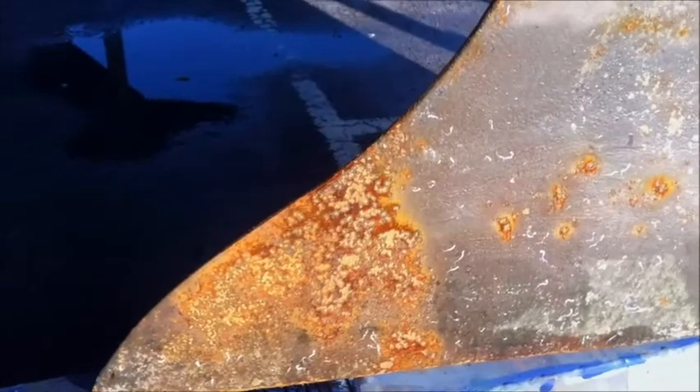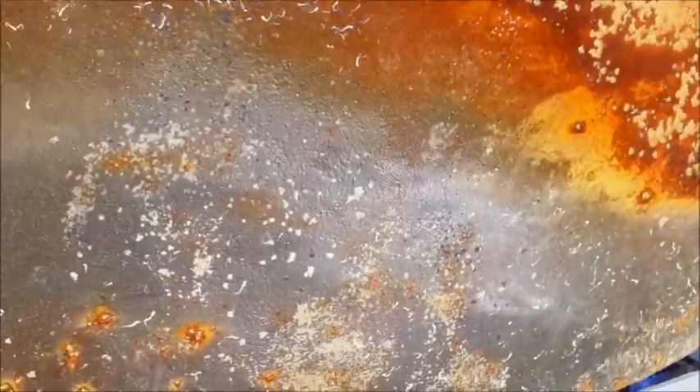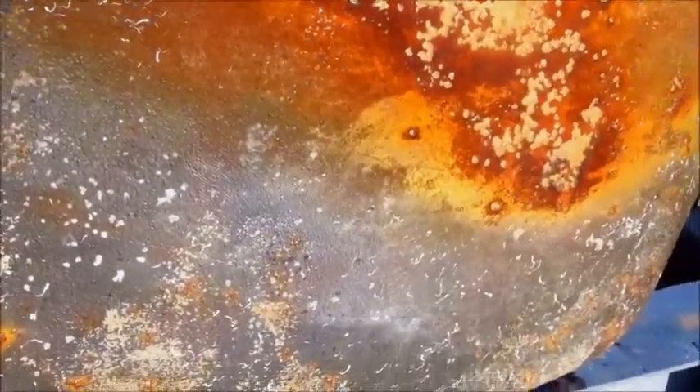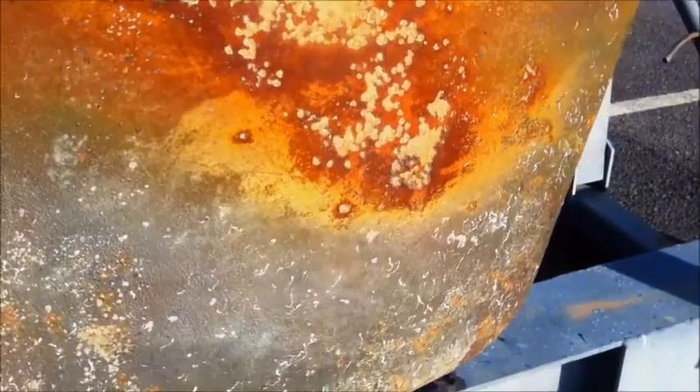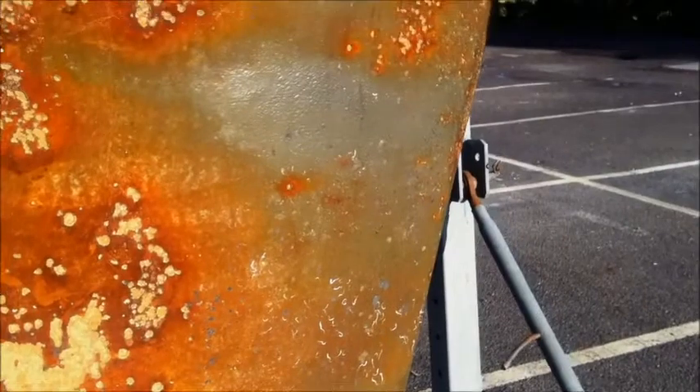It's a greater area than we were expecting. We bought some anti-foul to patch a small area — we may have just enough. Yesterday we went to the DIY store, the hardware store, to get some rust treatment for this cast iron keel. We will apply some red oxide, then put some epoxy primer over it, and then a couple of coats of anti-foul.